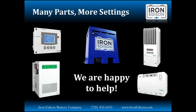And Brandon, one more question you can tackle about AC coupling and a generator. Ooh, this is a good one. In an AC coupled grid tie and battery backup system, can a generator also be connected? In other words, are the grid and AC solar array taking both the AC1 and AC2 inputs, thus not allowing for a third AC input, the generator, to be connected? Or do we have the capability of connecting a generator in an AC coupled battery backup system?